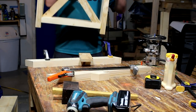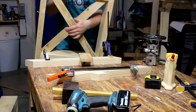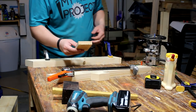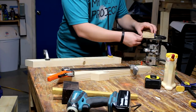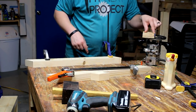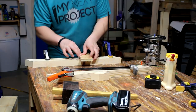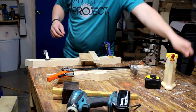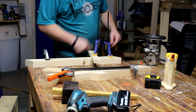The end of these, as you can see on the thumbnail, is going to have this X on the ends. So I've got to notch these pieces out in order to make them fit flush. What I did is I cut this piece of plywood from the scrap — it's the same width as my router base from the edge to the edge of the bit. So I'm going to put it right here and use it as a spacer. Then I'm going to come back with another piece, put it right there, clamp it down, and I'm hoping that will cut my groove right where I need it. So now I'm going to get my router and try it.